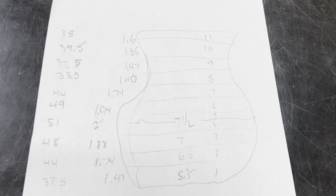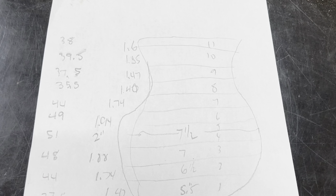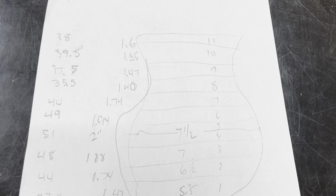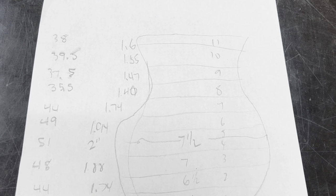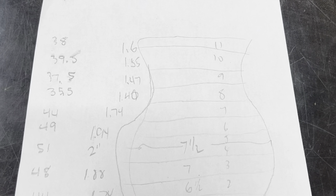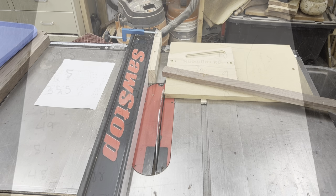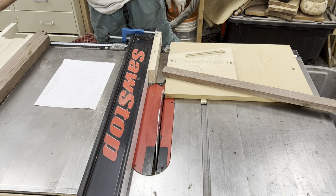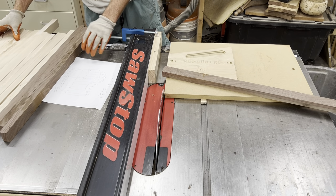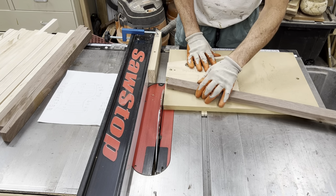So to explain it another way, if you look at layers 4 and 5, those rings I intended to be about 7.5 inches in diameter. So by consulting the chart using a 12 segmented ring chart and the metric conversion, which was 51 millimeters, each segment of that ring would need to be cut 51 millimeters long at the proper angle on my jig, and that would result in a ring of about 7.5 inches.